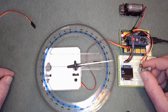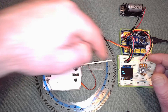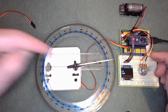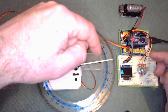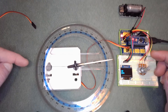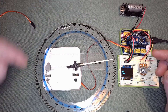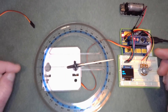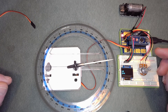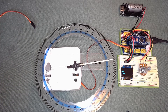You can just see the servo moving. So rather than a range of 4 to 172 degrees (168 degrees), we have a range of roughly 2000 µs — from about 550 up to about 2500. That gives about 12 times the resolution using microseconds compared to angles, and this is quite useful for the sweep I'm about to show.